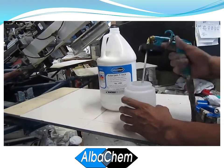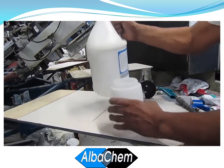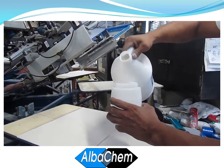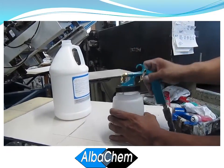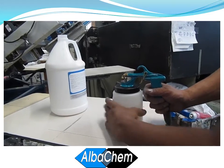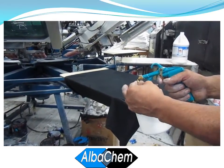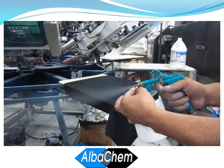Now we're in our shop and we're going to be using our AlbaGrip gun with Albatross SafetyTac pallet adhesive. SafetyTac is a thin-bodied water-based adhesive designed to be sprayed through pneumatic sprayers, but it can be brushed or carted on as well. Here we have our air source already hooked up to the gun, working at about 70 psi, and now we're going to show how to adjust the flow — how much adhesive comes out at any given time — simply by raising or lowering the nozzle.